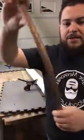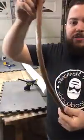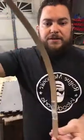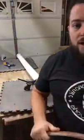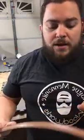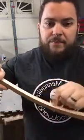So this is one that I just steam bent, a piece of oak trim. I was playing around when I was getting ready for this, so you can bend this stuff pretty well. Here's a couple things if you are going to do this for quarter trim. I do have some advice for you if you're going to go that route. Make some relief cuts in here. Get a little pressure off of here.